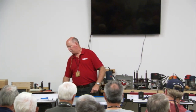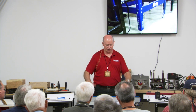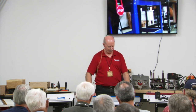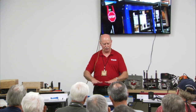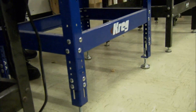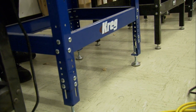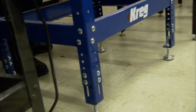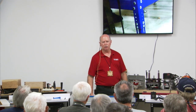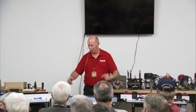The Kreg stand is unique in that it has a lot of holes pre-drilled so you can set different heights. Since I'm tall, I like mine high — by just repositioning the bolts you can raise it up. I have mine at home on casters at a comfortable height so I don't have to stoop. If you like the Kreg stand but prefer the Jessem or Woodpeckers top and fence, remember these are all à la carte — you can buy their top, fence, and all that and put it on a Kreg stand. You might have to do some of the drilling yourself, but we're all resourceful woodworkers and can figure that out.